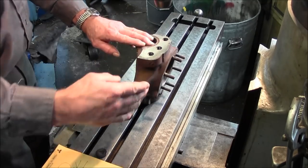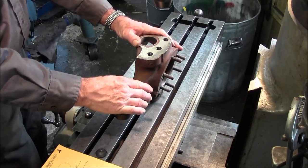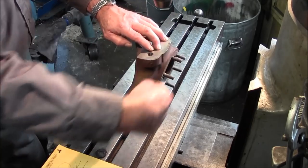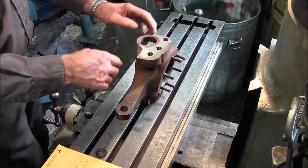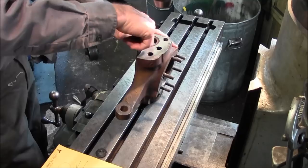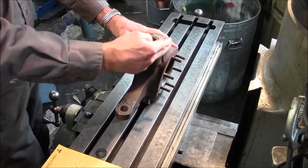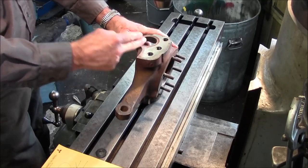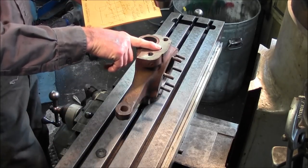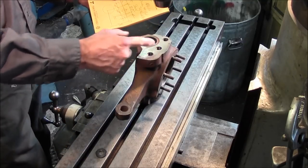So we're going to set that up with our axis cross slide here, and we're going to go ahead and put two studs in here and hold a parallel, and then we're going to dial the side of the parallel. And then once we have that running true, we're going to tighten up the bottom here, and then we can come over and locate this hole here, and then come over and locate center of those holes there, and then we'll have a known distance out this way here. And then from center line, we already know that it's drawn out here, and it's 7/8 this way and 7/8 that way. This one here is 3/8 of an inch down from those.